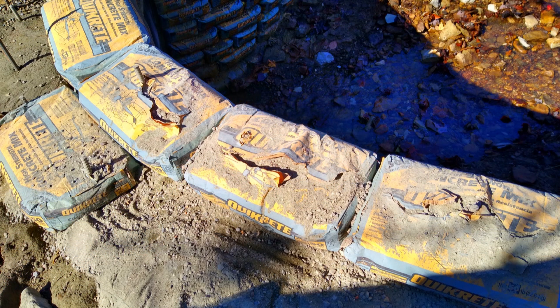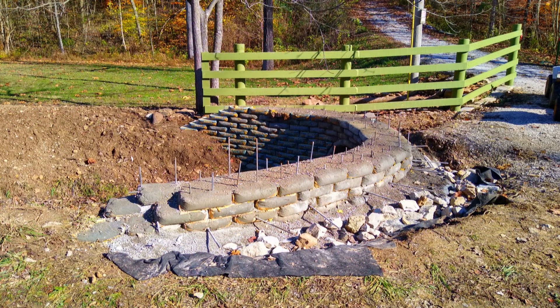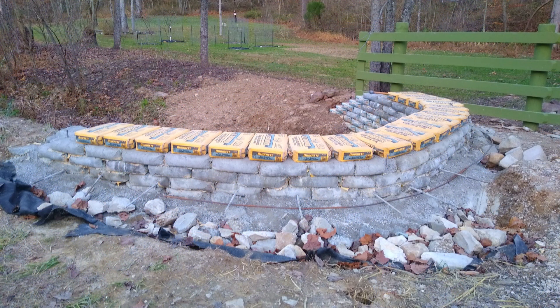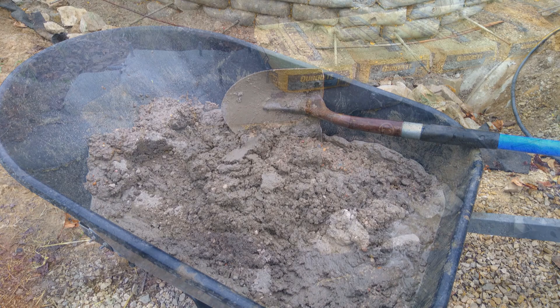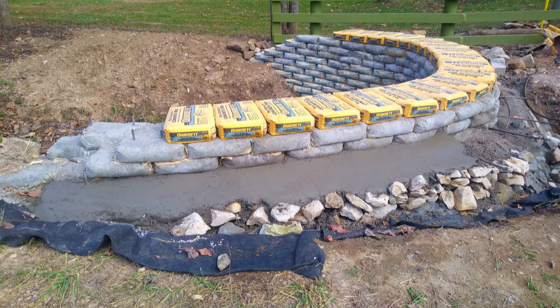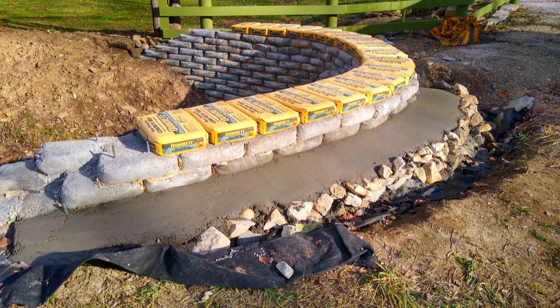You can take the bags and actually remove the concrete and resize them as you wish for the various row heights. Here, 80-pound bags are going to bridge these two rows and then I'll put concrete on the back as a spillover to finish up there. Because I don't like it to crack, I put rebar in it — it probably isn't necessary but I do it.